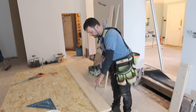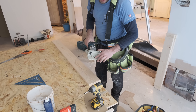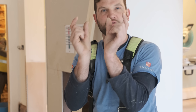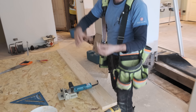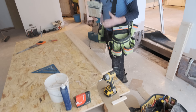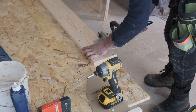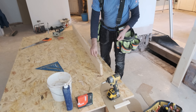A little tip when doing this: I have my line lined up with the centre of my cutter, but I like to move it a couple of millimetres each side of the line. What this does is make the groove slightly longer, so when you've got your biscuits in it gives you that little bit of extra adjustment to line everything up and gives you that bit of freedom to pull everything in. These machines are quite accurate, so you don't have to — it's just a personal preference. That's all machined up, ready.